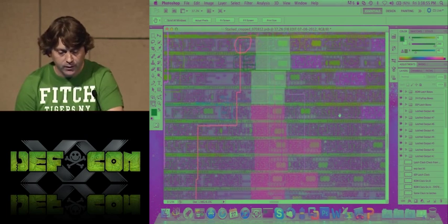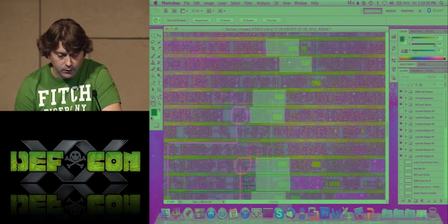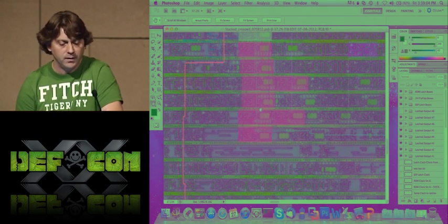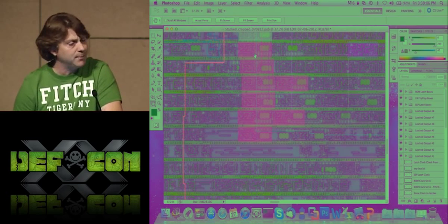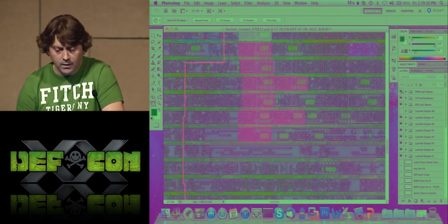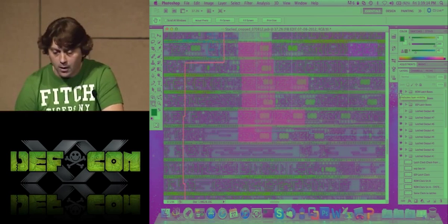So you can see here's 8 more. Here's 2, 4, 6, 8, and then I change the color, and this is coming from EEPROM. The EEPROM comes down and it gets latched into these next set of red boxes, and they're all happily coupled together, tri-statable. Only one's ever on, of course.